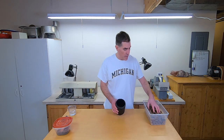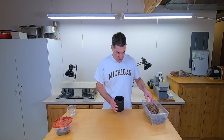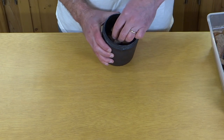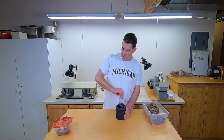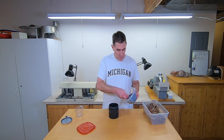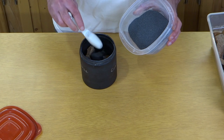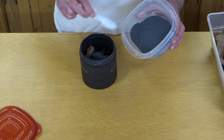I'm going to use a 3 pound barrel and I'll just throw some in there. Try to get about two thirds to three quarters full. That looks about right. I use a half cup of water in a barrel this size — most people probably use a little more than that. I'm using silicon carbide; this is 80 grit. You could use 60-90 or 46-70. If you're using a bigger barrel I'd suggest a more coarse grit like 46-70, but in a small barrel it really doesn't matter too much. I'm going to put 3 tablespoons in there.